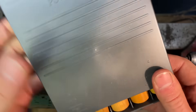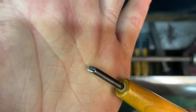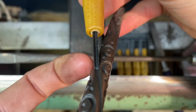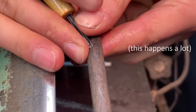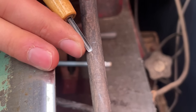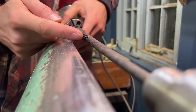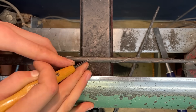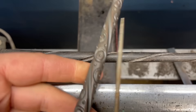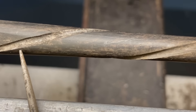At long last I finally dusted off my wallet and bought some carving tools. Even though they're a bit fiddly to open they are razor sharp and the gouge is a perfect size for the spiral on this wand. A general rule of thumb in woodwork is that cutting is always better than sanding — basically it's because a super sharp chisel will slice off the grain fibres and minimise tear out. It's the same reason professional woodturners don't use carbide woodturning tools. I could use a Dremel but I'll touch on the downsides later. I found this miniature file that is the perfect diameter and I'm just lightly running it down the channels to straighten up the wonky sides from carving.